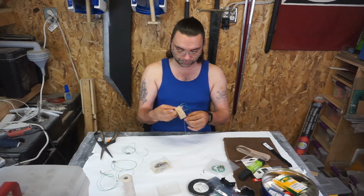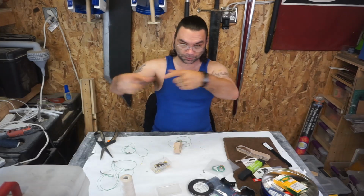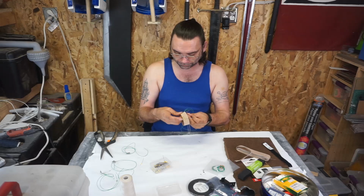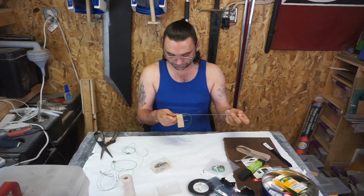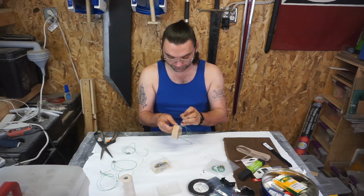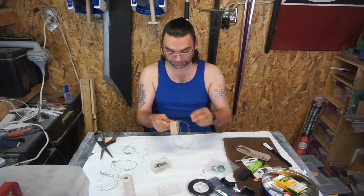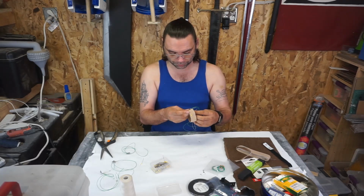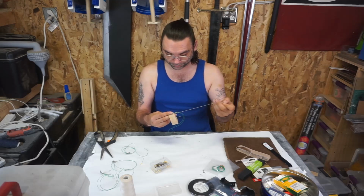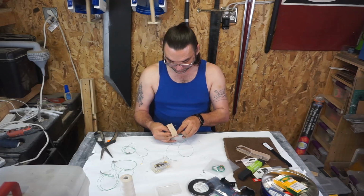And since I've recently switched to Core XY, which is where the bed stays still and the top moves around all cool like, I've gotten really obsessed with strain relief because I made most of my printer, and my favorite one was my Hypercube just because it was neat and I fully made it myself, you know? I've been obsessed with strain relief lately because of it, so I'm adding an extra stitch just to make sure there's no stress on these wires. I don't want to go through all the trouble to have a wire get ripped out and then have to solder it. The less I solder, the happier, because like everything else, I hate soldering too.